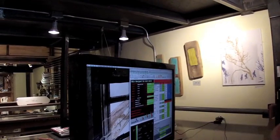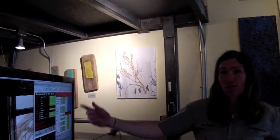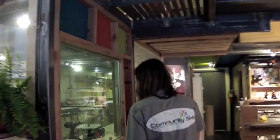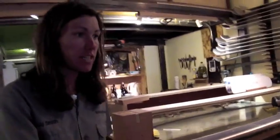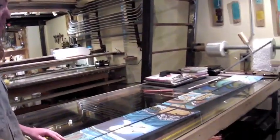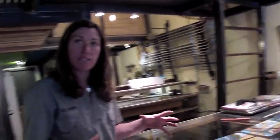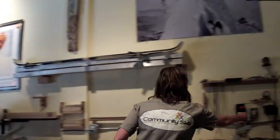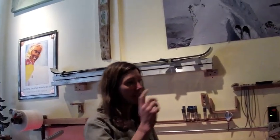Hi, I'm Kristen, and the process begins right here with our design software. That's through a conversation I'll have with the client, which turns into numerical values of the ski. Over here is where the process begins. This is where the core and the P-TEX is cut to shape, and behind me is where the P-TEX and the edge gets assembled. And right over here we've got some custom graphics that have already been designed and printed out. When all these materials have been prepped, it goes into this area where the ski gets built—where all the materials get layered up, vacuum bagged, put into our press, and go into the hot box for about 45 minutes. When they come out, the ski gets finished.